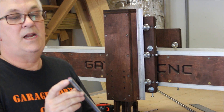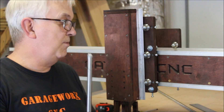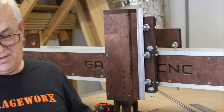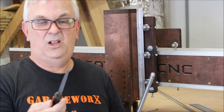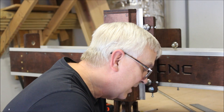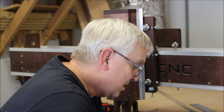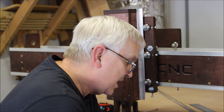If you want to put that bearing on there, here's what I suggest. I went to my shop and took my sander and just held the lead screw at about a 45-degree angle and spun it while sanding to put kind of a taper on there. Now before I try to stick it through the acme nut, I want to take one of my couplings and see if it will thread on there. I can tell the sanding boogered up the threads a little bit, so I'll take my trusty file and go through and catch each one of those threads and just hit it a little bit — all I'm trying to do is make sure there are no burrs that are going to damage the acme nut as I thread it through.